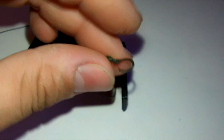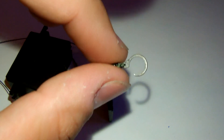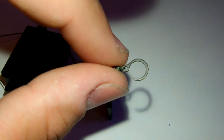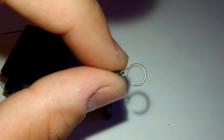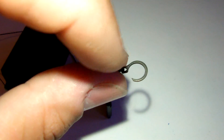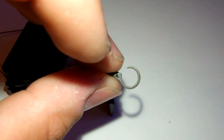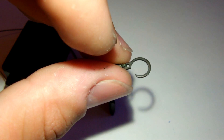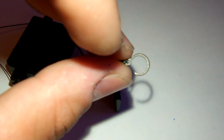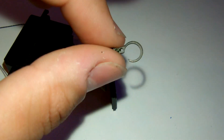For the hook, instead of using keychain hooks, I made my own so it fits more into the 1/24 scale. It's extremely easy to make — you don't have to buy anything special. Just get an external snap ring and grind down one of the ears. Make sure it's an external snap ring, not an internal one. Take one ear out and you end up with a hook. Because it's a snap ring it's made out of steel, so it's extremely strong — way more than you'll ever need for 1/24 scale. They come in all kinds of sizes, so you can go bigger or smaller as you like.